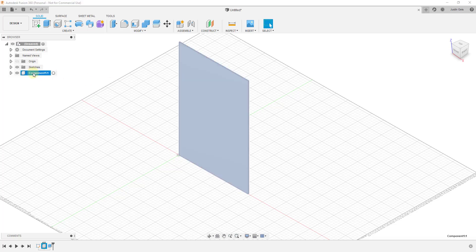One thing you may want to do as you go is relabel these components. I like to use the dimension and also what it is. So in this situation I'm going to type in: Plywood, quarter inch, dash, 42 inch by 29 inch. You don't have to do it this way, but I like to because we're going to schedule this out later, and if I'm descriptive then everything that shows up on this list can show up in my schedule.